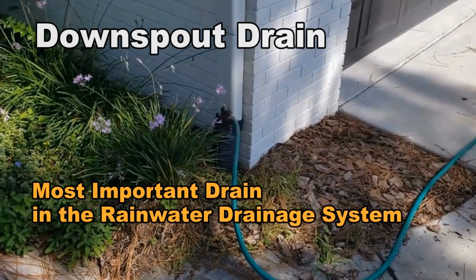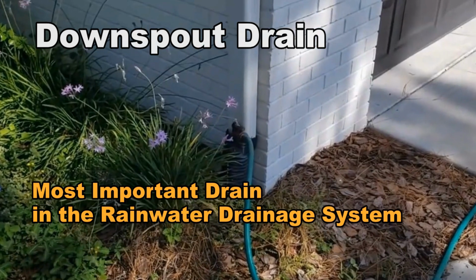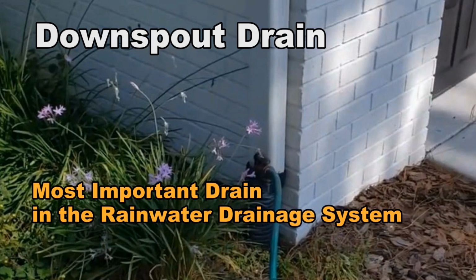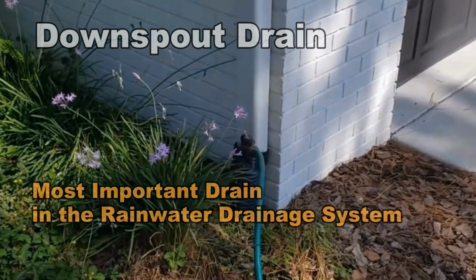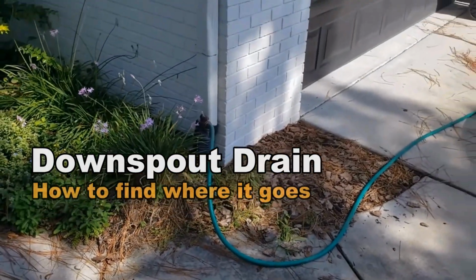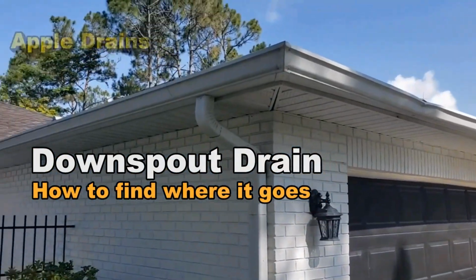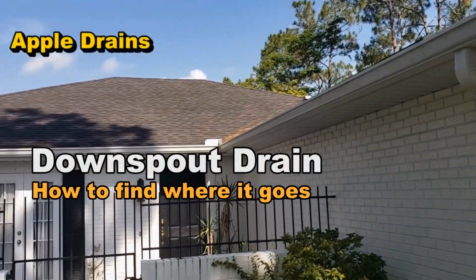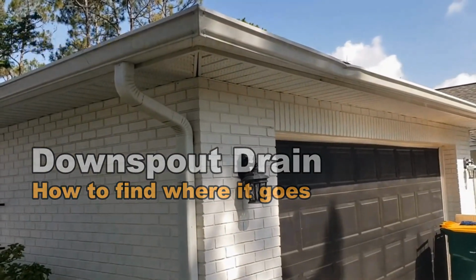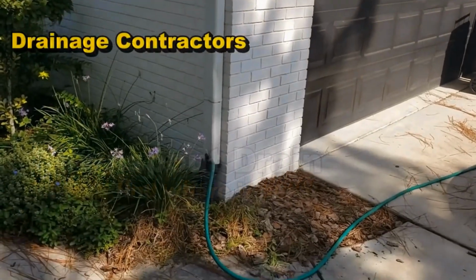The downspout drain is the most important drain in the rainwater drainage system. This drain protects your home from flooding beyond any other drain. As you can see, if you look at the roof, look how much water comes off of this roof. On this roof, there's over 2,000 square feet coming to this one downspout. And if that backs up, you've got problems.